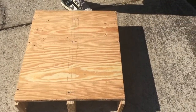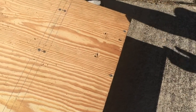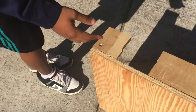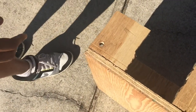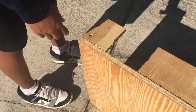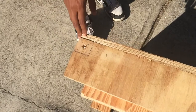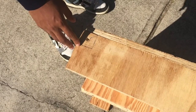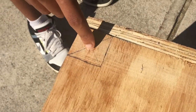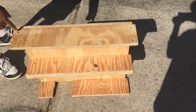However on this side where there's this singular piece where I put the motor, you're going to want to do two screws to add extra stability. There are going to be holes that you're going to want to drill on each piece of plywood on the right and left side of the frame — it's a 3/8-inch hole to make room for the bolt. How you're going to do this is just measure two inches up from the bottom and two inches across from the corner, just draw an X, and then in the middle of that X just drill a 3/8-inch spade bit into the middle.